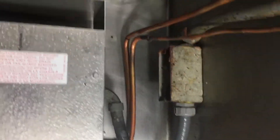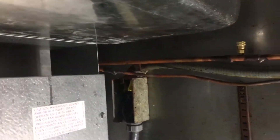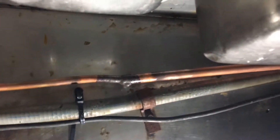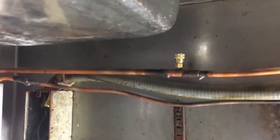Here's how the pipe runs: quarter-inch liquid going into the three-eighths for a small receiver effect, and the three-eighths liquid and three-eighths suction coming back into the half-inch main line, with a service cap for superheat.